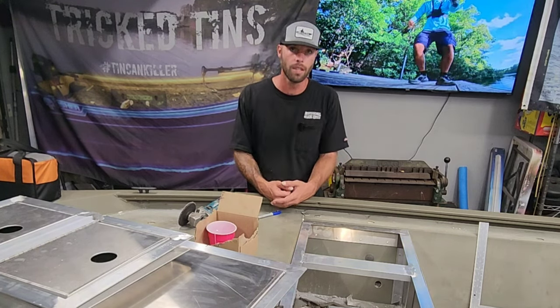The vertical supports for this. Now the way that this kit's going to come, it's going to come with an inch and a half angle down here. I used a 1-inch angle because I already had that here, but I'm going to send the kit with an inch and a half angle. And these are going to be 1-inch square tubing risers. Now these pieces are going to be pre-cut. They're probably going to be about 13 inches because these ended up being like, I think, 12 or 11 and 7/8. But I did notch them, you can see, and I welded it from the face right here, from the front side, top and bottom.